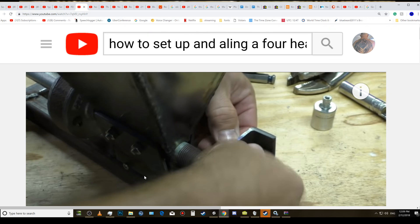He's got some of the right equipment but some of the wrong ideas. He understands that plastic has to be managed, but not with a water bath at this stage — this is only an interim stage, remaking filament, so you've got to keep it dry. Do not put filament extrusion through a water bath — you're going to have failure after failure. He did have the right idea using clear pellets so he could see what was happening. Your first tests should always be done with clear filament, and it needs to be hopper dried first.